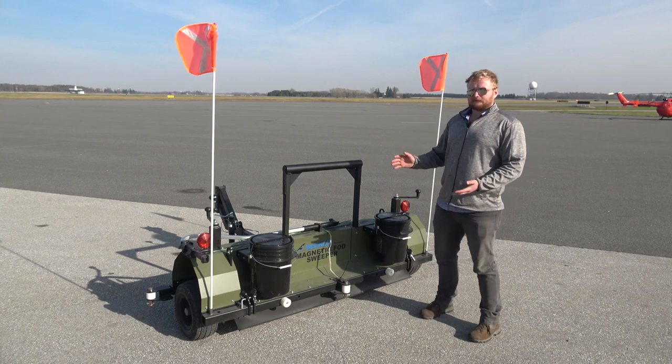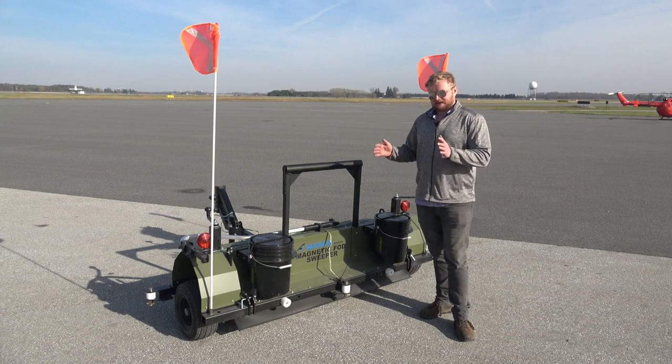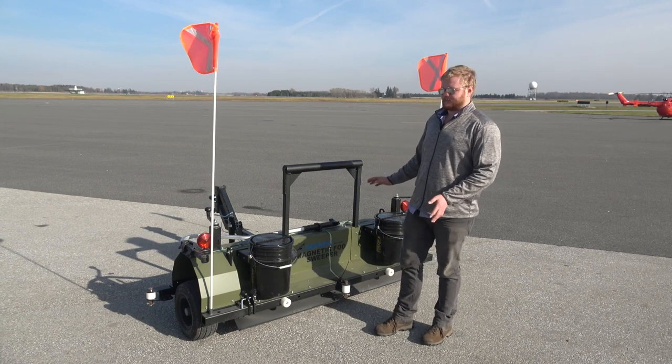It's a 12 inch by 3 inch ceramic magnet. The reason we did that is because a 12 inch magnet has a lot more surface area, and three inches high because the field doesn't need to extend further — this thing only operates at a maximum of three inches.